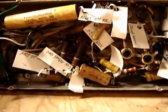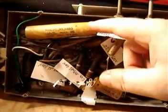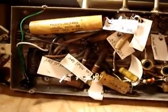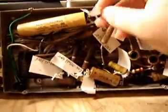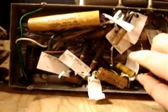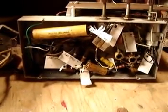For the most part it's in pretty good shape — I don't see anything leaking. Right from the get-go you can see a big multi-unit filter capacitor here, and another electrolytic capacitor down here. Generally speaking, you want to change out the electrolytic capacitors on a machine like this. So before starting I used the schematic from the internet, located and labeled all of the capacitors, placed an order online, and received a whole batch of new ones. These are the 2007 vintage replacements, and these are the originals — those big ugly paper capacitors we're going to replace.